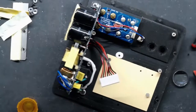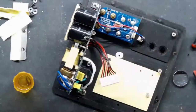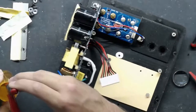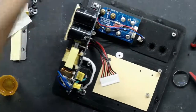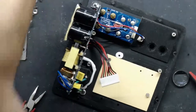I need to change out my soldering tip. I just dip it in the water and it falls right off — it's beautiful. I need my large tip to get these big power supply caps. Quick and easy way to change tips without losing all your heat: just dip in a little bit of water.